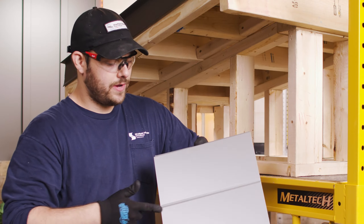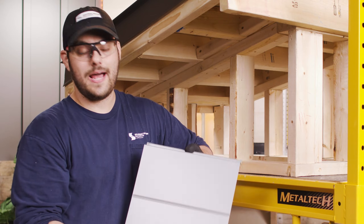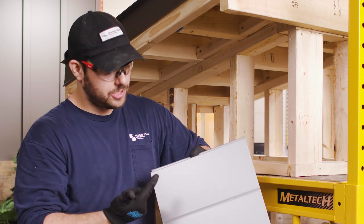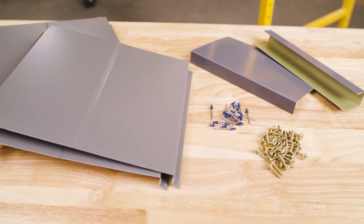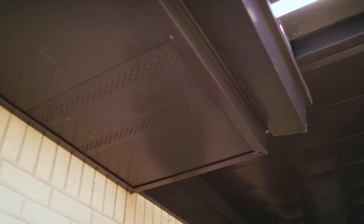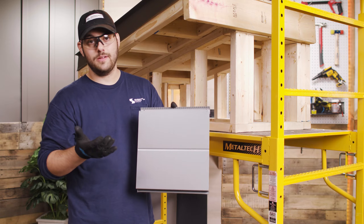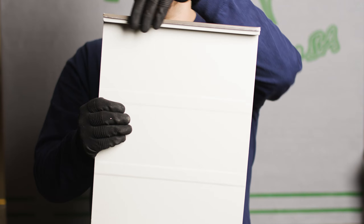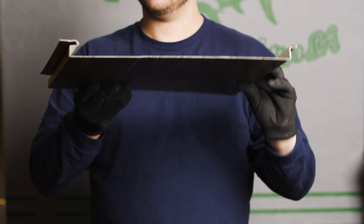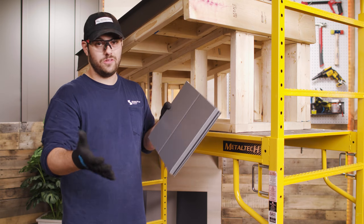In this panel right here, this is a 12-inch panel, and I've got a V-rib down the center of the panel. For a high-end residential application, 12-inch coverage is a little large, so I've got this V-rib here to kind of break up those eye lines. You can also roll these with perforations and any combination of V-ribs, bead ribs, anything that your roll former will take. This profile has a 1-inch rib height with a tongue and groove locking system, which allows the panels to lay flush across the length of your soffit. You can also roll form them to have a reveal as well, so there's a ton of different looks.